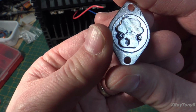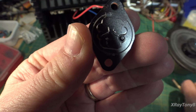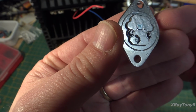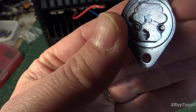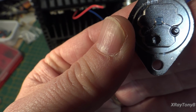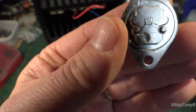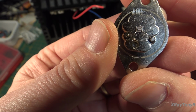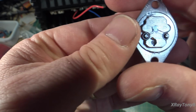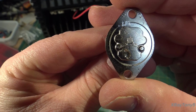Now I'm going to try to zoom you in real close. If you take a look here, do you see that little die there in the middle? You see it right here? Right there. You notice how there's like these little zigzaggy lines in there. See how close I can get. See them? Hopefully I got it in there in a way you can see it. And get some better light on the subject. So there it is. You see them? It's kind of like two E's that are fitted together like that. Those are your PN junctions. And those are called finger junctions.